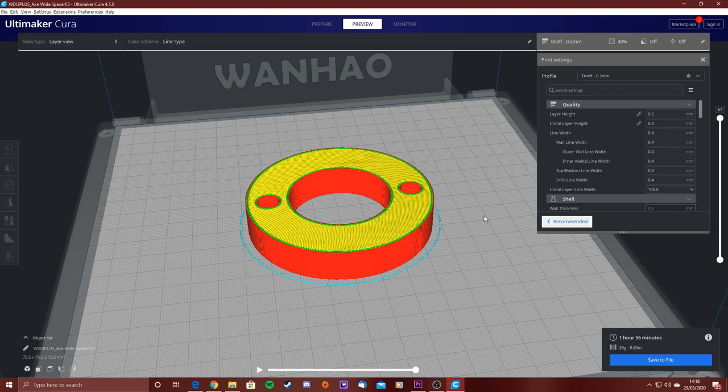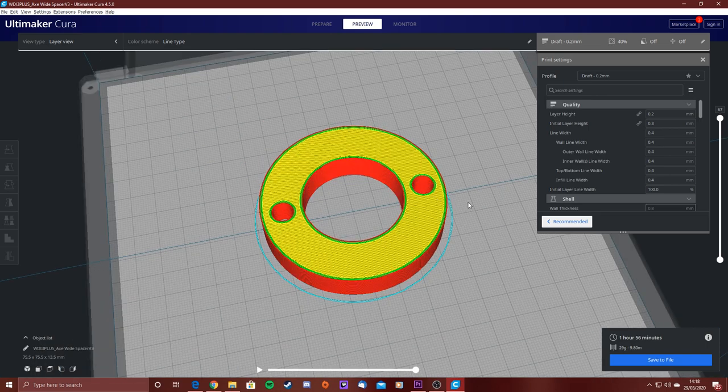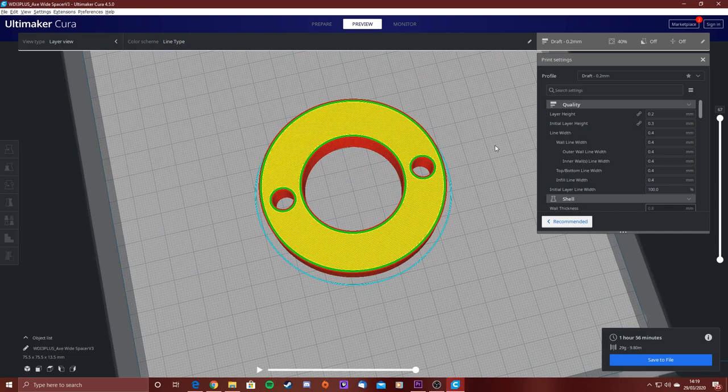It also provides a perfect guide as to where to drill the holes, because I could just snap that into place, drill the holes, and Bob's your uncle. There's been a few iterations of these, but the V3, which you actually see in the video. I've tweaked a few different sizes over the iterations so it fits nice and snugly. This is just printed with standard draft settings for PLA, and then I'll print it out of Polycarb, the Polymaker Polymax PC, when I come to do the final thing. But this is just to get everything lined up, so let's get that printing.